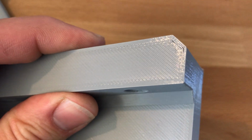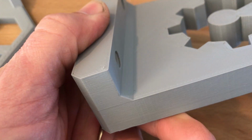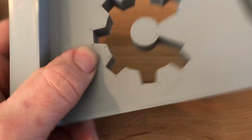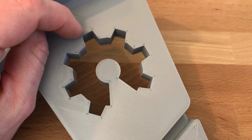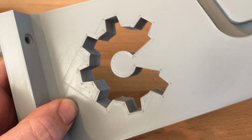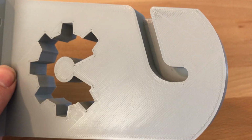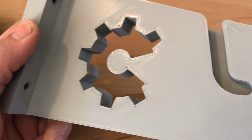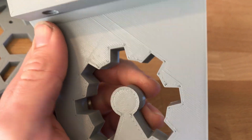By the way, the layer width is 0.48. I had entertained bringing it down to 0.45, which I believe is what the Prusa Slicer settings are by default. This is done in Simplify 3D, so please don't just reply with use Slicer. I'd like to get settings that do work in Simplify 3D. I've been using it for years, and there's a couple other workflows in it that are advantageous for the work that I typically do. But I'm just curious, should I be expecting a better surface finish for 0.2 millimeter, or is this pretty common?